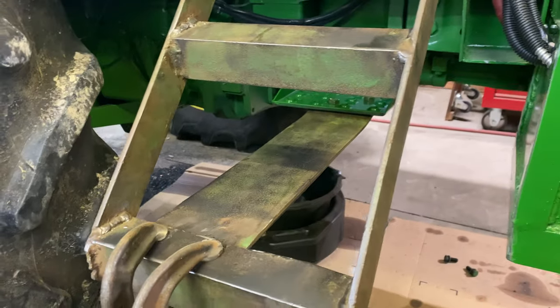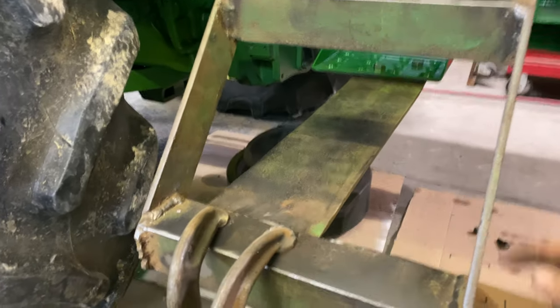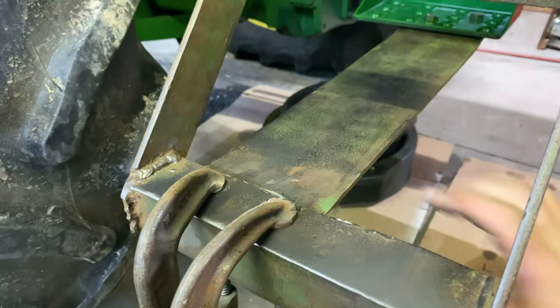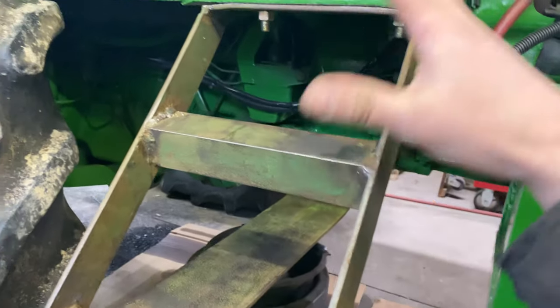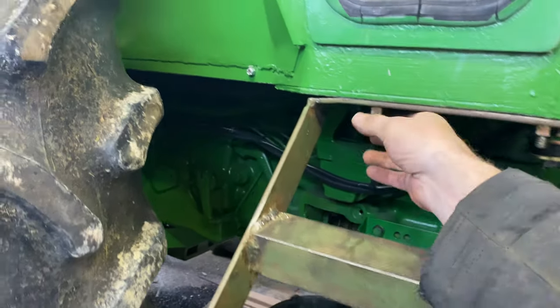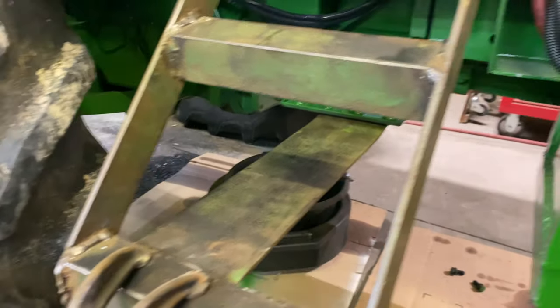Okay, holes drilled, bolted up, clamped up. I think we're ready to weld this here. The mate here wasn't real good, so that's why I got two clamps on here to really try to draw this step down into this piece. Hopefully that doesn't affect our bolt alignment too much. I've got everything roughly tightened. It's not like tight, but just snug. So, okay, let's weld it.